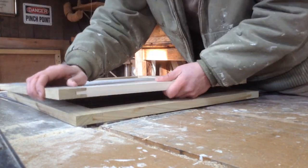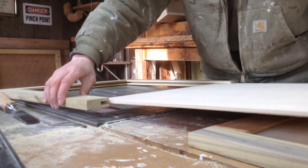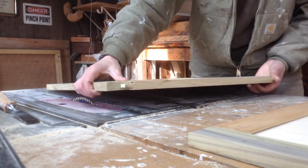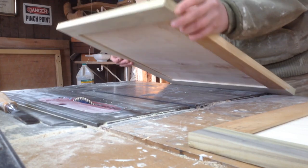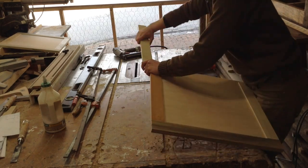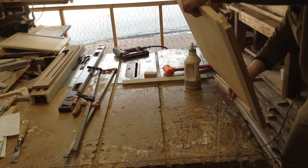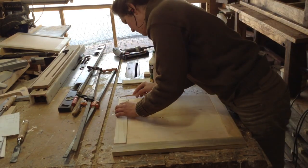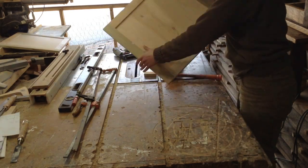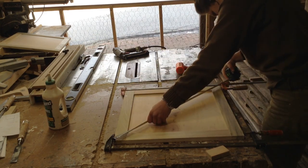The inside panel is quarter-inch finished cabinet-grade birch veneer ply. Most of the material was already ready for me to start building, so these went together pretty quickly. To glue these together, I'm only adding glue to the tenons. The plywood is dimensionally stable and won't really move around on you, but the outer frame of the poplar will, so I never glue in the panel pieces. I pop these back together, always check for square, and clamp them up. I'll add clamps to the side to pull the joints together, and sink a brad in each corner on the back side — that's how I let those dry.